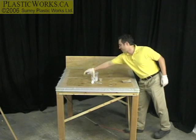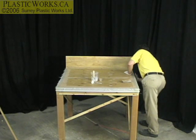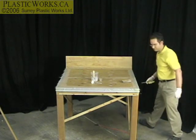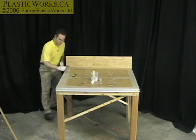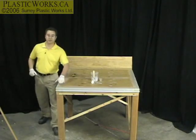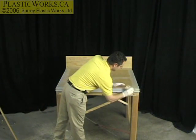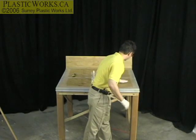I'm just going to grab the knife and do a bit more trimming with it. That'll work fine for what we're doing — just doing it along the front here, getting any loose fibers off again, because we don't want those in our gel coat layer. They can come up as sharp spots.